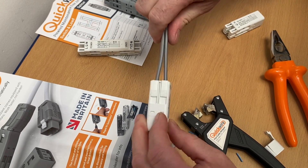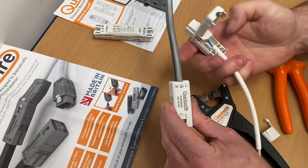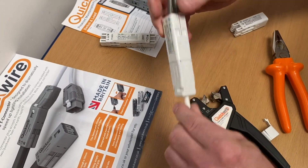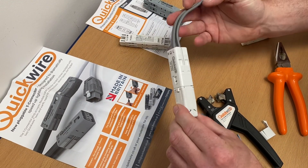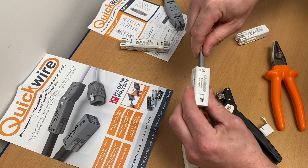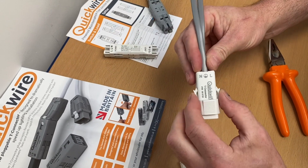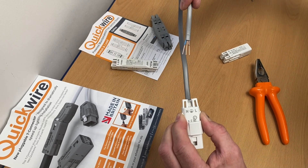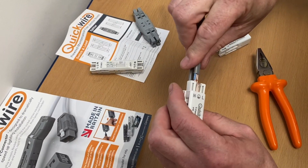That's the T connector made off. If we bring in the pre-made flex - this came with the kit, already pre-made up - you'd bring this in for your lights. There you go, that would be connected. That would have our LED or modular lighting system wired in a flash. You might be thinking: how would I remove those cables? This little bit of kit - slip it into position right there, push away, and they come straight back out. Not difficult at all.